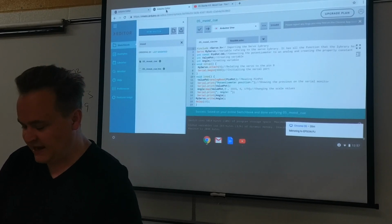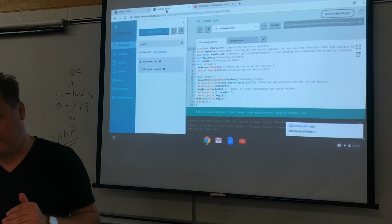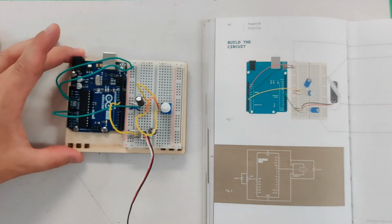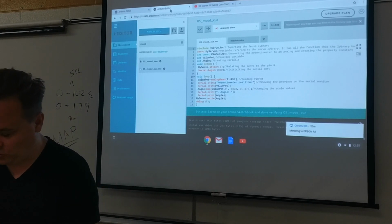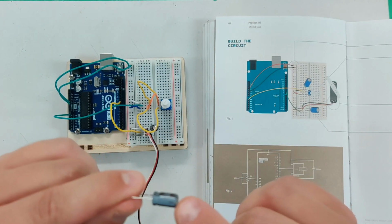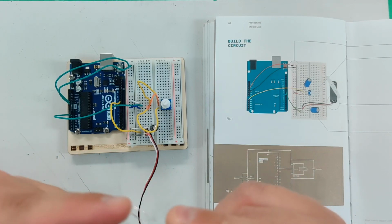So, a couple of wiring notes, and this is very important, because I'm using the same kit you're using in theory, and there is some tricky stuff. First of all, let's see how the diagram has it. Now, these are very important. The most important thing is when you take these capacitors, you have to get this right. The side with the stripe, right there, is always the shorter wire. It has to connect to ground.